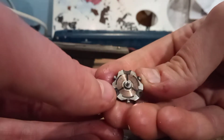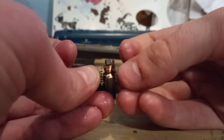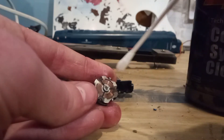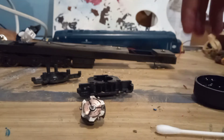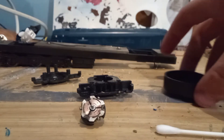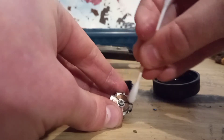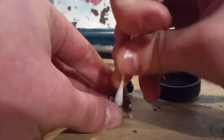As you can see it's a bit hard to see but it is a tad bit dirty — though I have seen worse. For some reason the copper is white on one side. What we're going to do now is clean this commutator. We get our solvent mentioned earlier and a few cotton buds, dip the bud in the solvent, and just clean around the commutator. We also clean the springs and brushes — you can drop them into the solvent and leave them to soak. This is done so the electricity can conduct easier again and make it easier for the model to run.